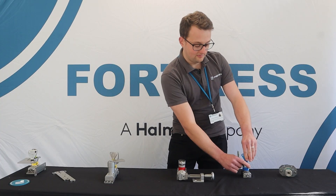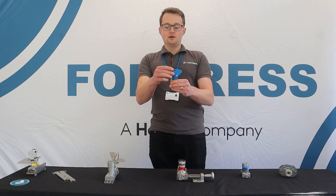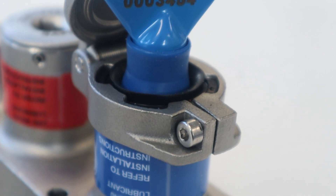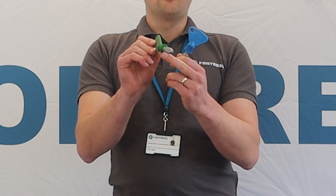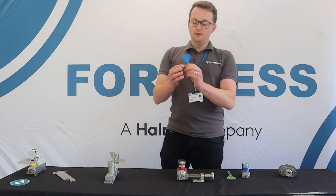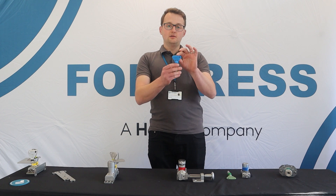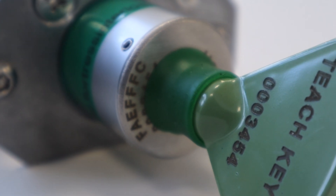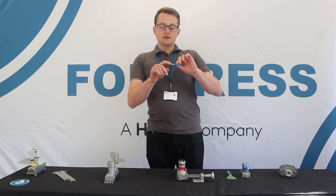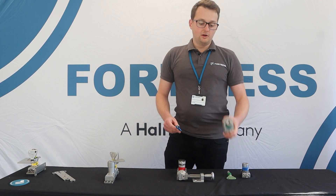Each key looks a little bit like this, and you'll see there are lots of different colors — keys can come in blue, green, red, yellow, amongst a number of other colors. That's for the bow of the key, but also the seal which prevents any dirt going into that lock barrel. Each key has a unique engraving which you can assign and use as an identifier, and it also comes with a unique one-in-two-hundred-thousand differ — the cut of that key which is unique to the lock barrel it will work with.